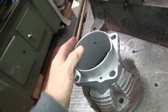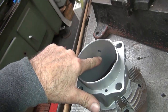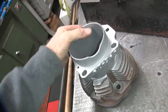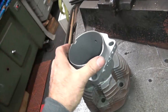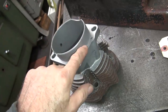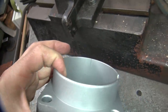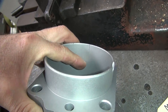So if you're going to do a stroker motor on a panhead and you buy the '52 and earlier cylinder, you don't have that hole — the oil ring does not get into that, and you don't have to plug it. So the preferred cylinder for a stroker motor is your early cylinder. Now if you sleeve these things, obviously the hole goes away. At this point the cylinder can be sleeved because it's broken down here, or you can run it because it doesn't really matter too much right there, as long as it's not broken anywhere else. If it's got two cracks coming down, that's a problem — when it's making the curve right there, that makes it weaker.